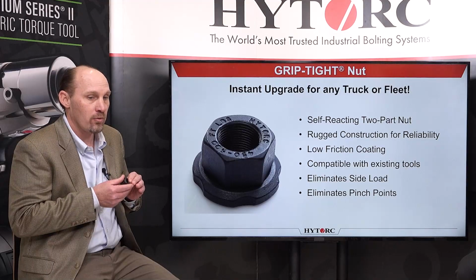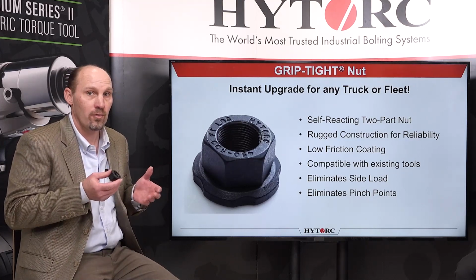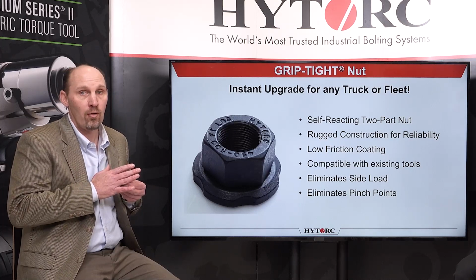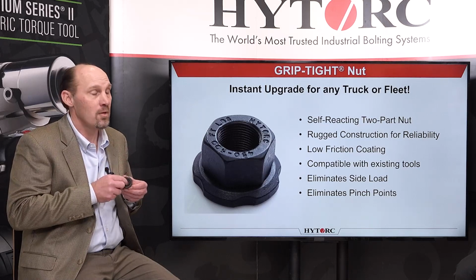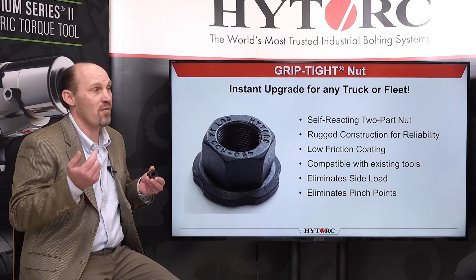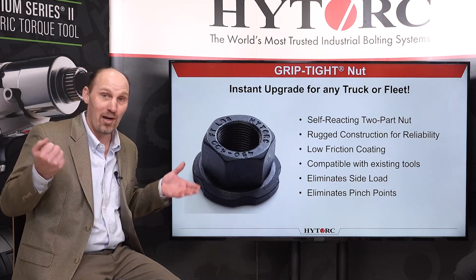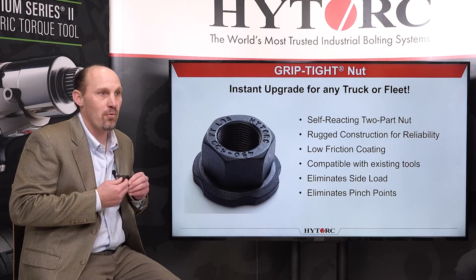HYTORC's been doing industrial fasteners for over 50 years. And in those 50 years, we've worked with a lot of large fasteners. In general, most of the applications we work on have torque values that are upwards of 1,000 foot-pounds. We even go up to 100,000 foot-pounds sometimes. So we often have to deal with reaction points. Reaction points mean we have to push off of something. You can't tighten a fastener to 50,000 foot-pounds by pulling on a wrench. The wrench would be just too long. It might need to be 150 feet long. And so what you do is you use a reaction point.